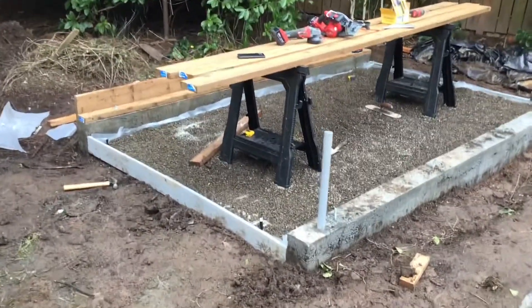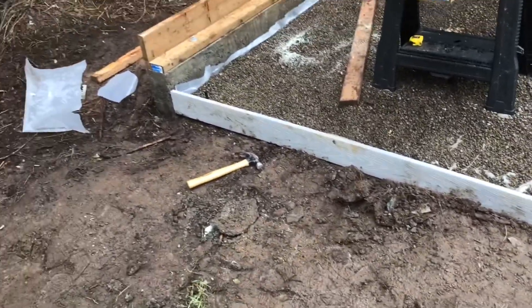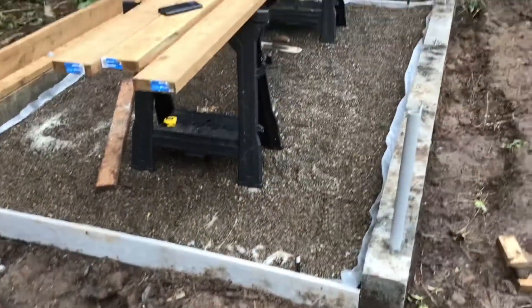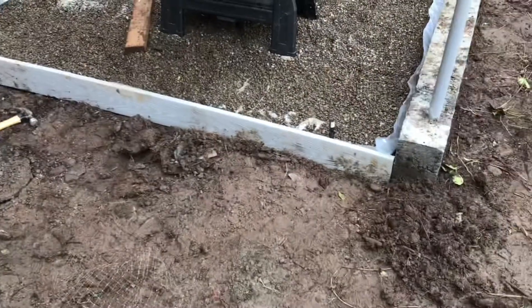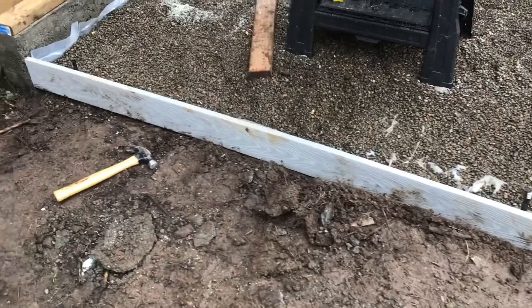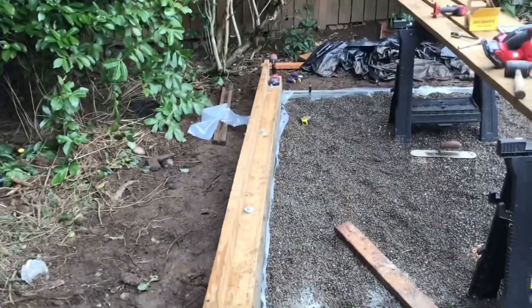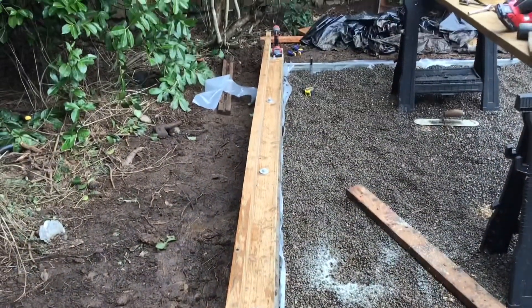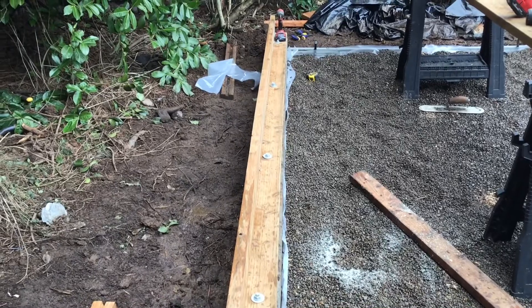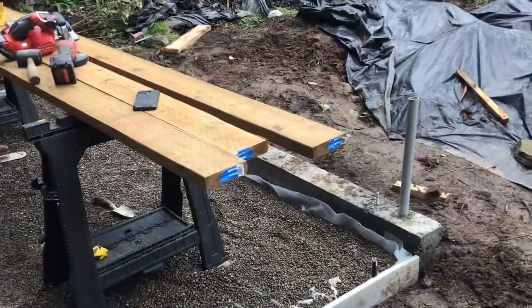Quick review of where we're at. Got the gravel spread yesterday. Today I put in these pieces of synthetic decking, front and back, to keep the gravel from falling out and give me a nice clean edge to mow and weed eat against. This will eventually have grass again. I put up one rim joist and sill plate. It was early in the morning, there wasn't enough light to film, and I wanted to get the kinks worked out before I recorded it. So let's do the other side.